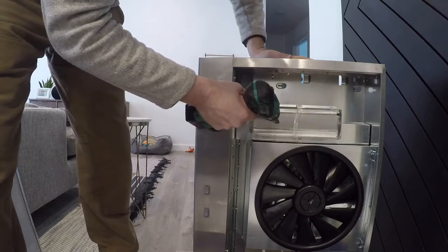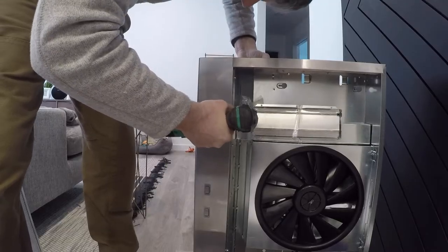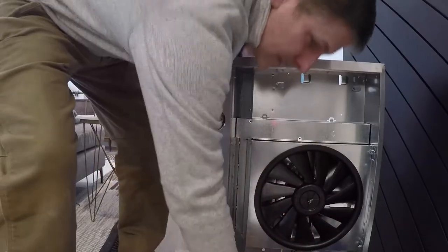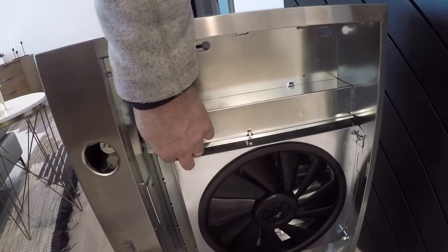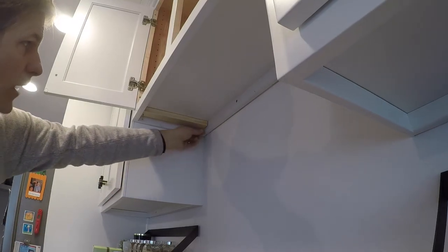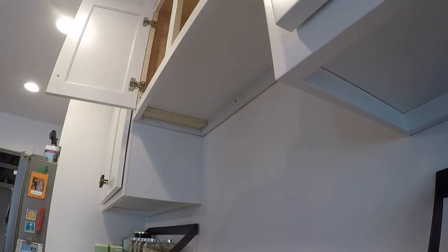Here's the vent piece that we probably won't need. Underneath here are our nuts and bolts — there's our package. These are our mounting screws. We're going to go ahead and attach those to the shims we already installed. Just above the fan on the right side of the hood is where we'll make the electrical connections, and they'll come right through that hole. We left the four screws out just a little bit so that the range hood can come in here and rest on these, and then we'll tighten them from underneath. Right now they're all protruding just a little bit so we can get the range hood on.